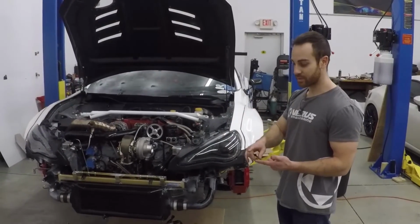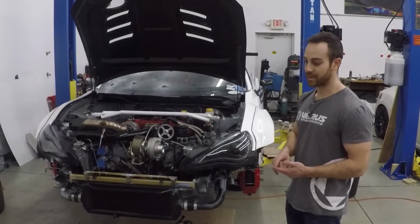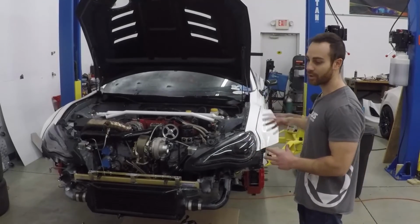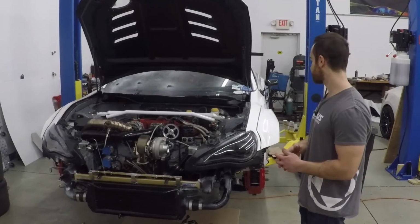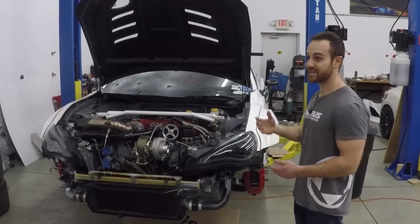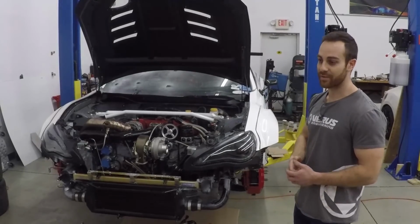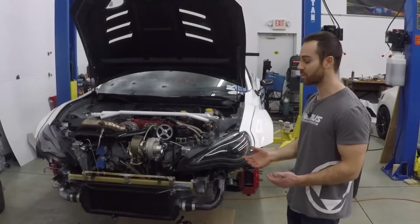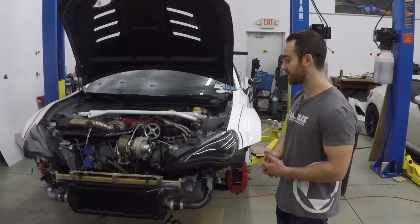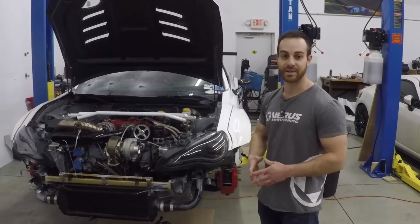We basically took out the splitter, the rear wing, the rear diffuser. So we actually can, in CFD, approximate what each part of the car is making as far as lift and downforce. So the units before were actually counteracting 700 pounds of lift. So now our 1,700 pounds of downforce are counteracting that 700 pounds of lift as well. So that's actually 2,400 pounds of downforce that our kit is making. So I hope that kind of clears things up and makes a little bit more sense. But if not, just ask us and we'll try and clear it up again.